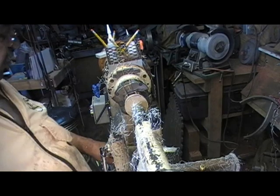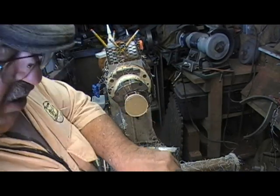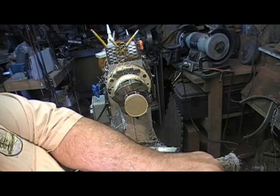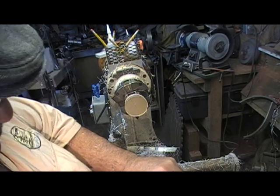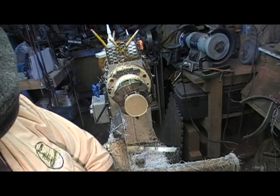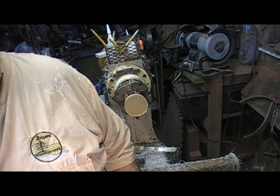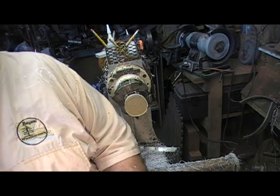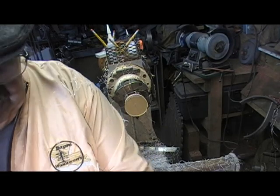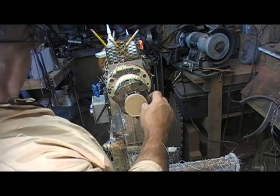We're a little safer now to pull the tailstock back and get it out of the way, mainly because the rest of our cuts are going to be essentially on the face and across the face. We're all going to be turning on smooth surfaces. They're true to the spin of the lathe, and they will have less vibration, less chatter, and less of a chance to have the tool dig in. That's what I'm talking about, smooth surfaces.